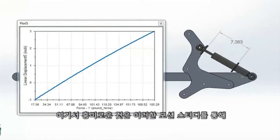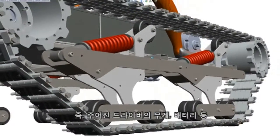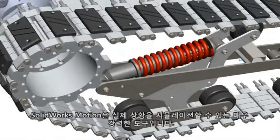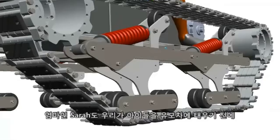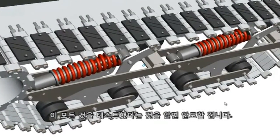What's interesting here is that these motion studies allow me to figure out where to place the shocks so that with a given weight of the driver, the batteries, and everything, we don't bottom out. SOLIDWORKS Motion is so powerful for simulating real-world conditions, and I think our expert mom Sarah would feel good knowing we tested this thing before putting a child inside of it.